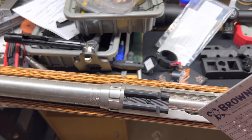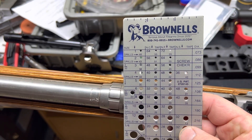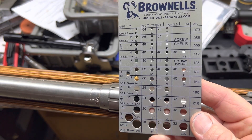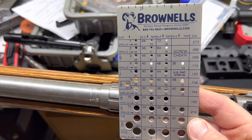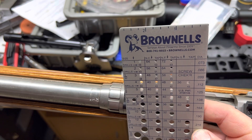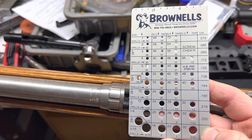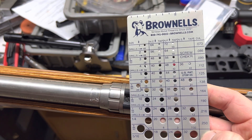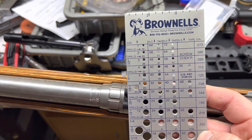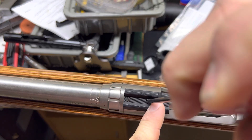That right there is what I'm going to use to figure it out — it's called the Brownells Screw Checker. It has pretty much every standard size that you might encounter in the gunsmithing world. It gives you your drill size, and it even has a little rule on top if you needed to measure the length. I figured using this might be a little easier than just threading a screw down in or mic-ing it, but I just wanted to give this tool a try and show you guys. So let me take one of these screws out and we'll verify what it is.